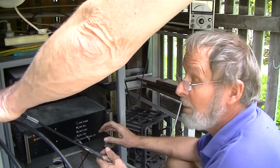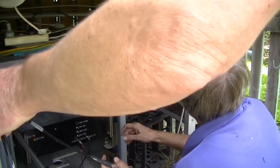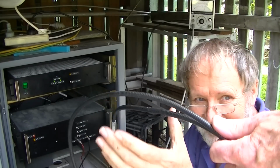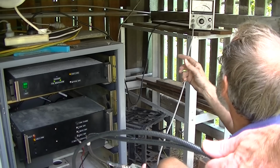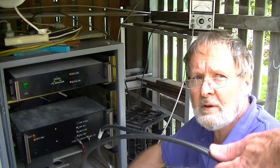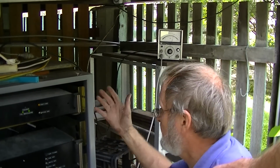Okay. Well, that's probably about right. No tune-up required, gentlemen. Good. So you're getting enough out? We're getting enough with these two bits of attenuation. It's 1.5 dB down on 100 milliwatts on the scale, so that means it's something like 200 milliwatts full power. So that's as it should be.